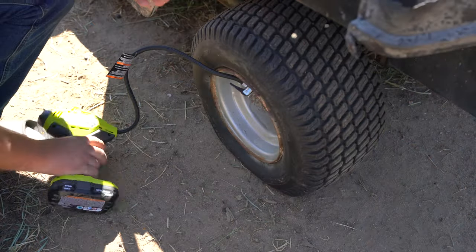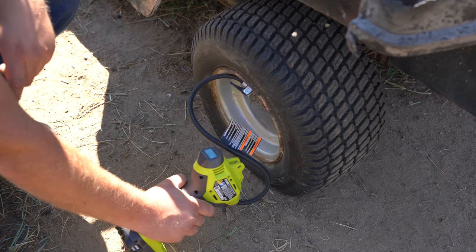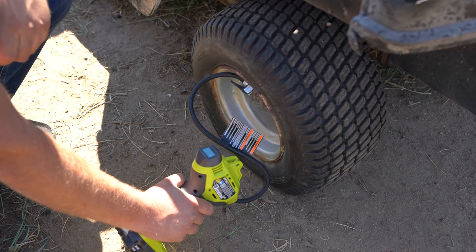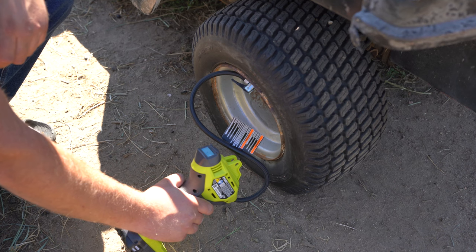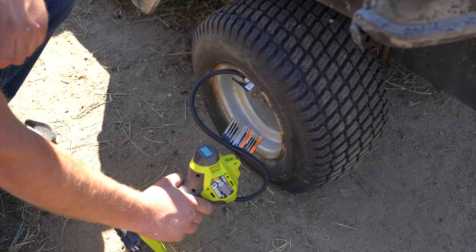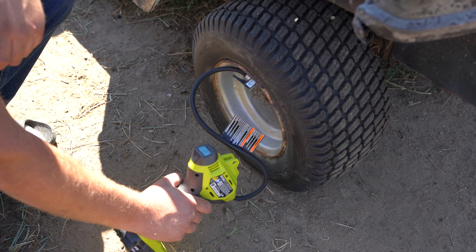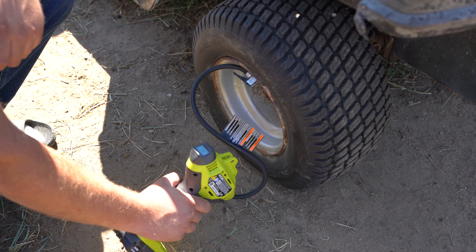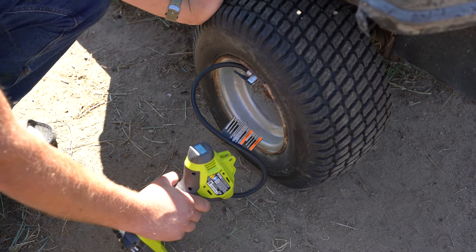So at the end of the day, the trigger is adequate for its intended purpose, but it's definitely missing some very useful features and a necessity for, well, when you are transporting this particular tool, a safety. That also means that you can't transport it in a tool bag with a battery in it because it will turn itself on and run out of the battery every single time. So quite frankly, the trigger needs a redesign, and while it is adequate, it's definitely not the best in the world. Quite frankly, it feels rather unfinished.